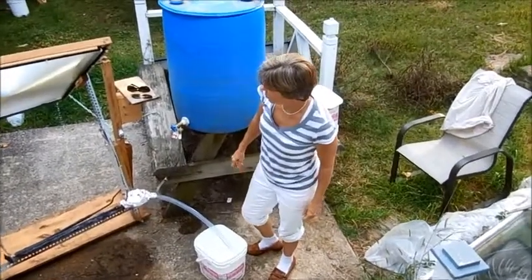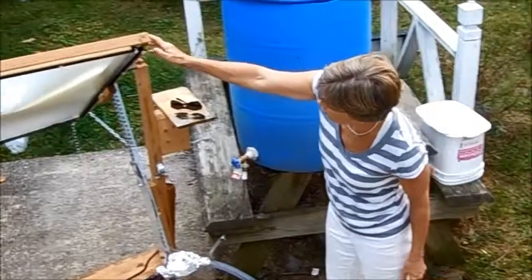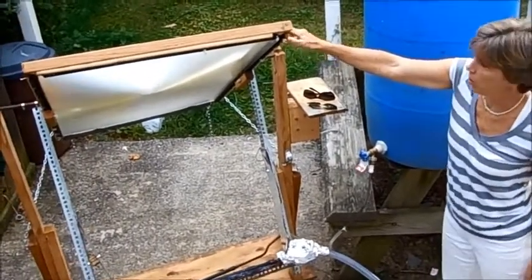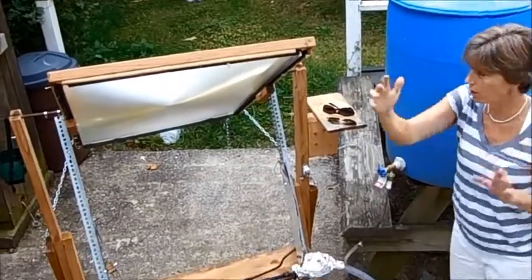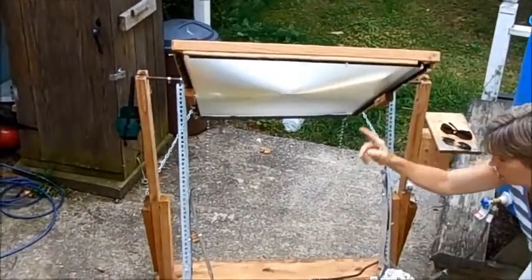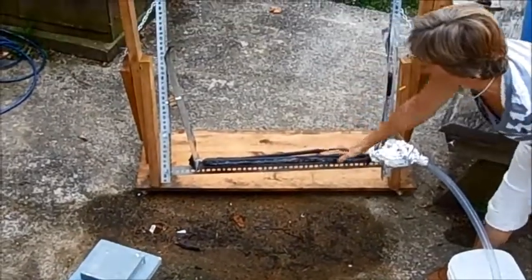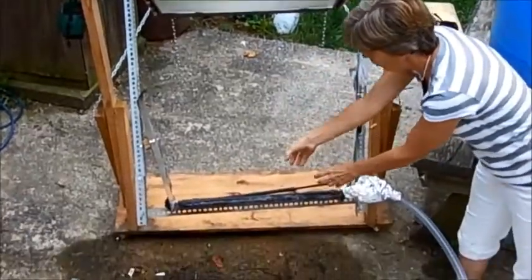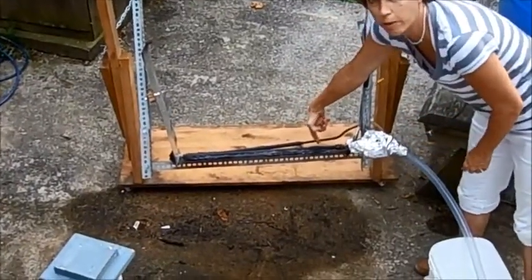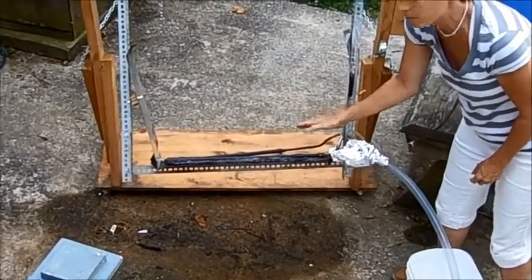There are just a few components to this system. This is the Fresnel lens — it's a 62-inch lens. It takes collimated light coming from the sun, which arrives straight, and focuses it to a point. The focal spot of this lens is located about here, behind this black coil. The black coil will intercept the incoming radiation and put it in a spot that's about 3 inches by 4 inches. The spot is not at the focus — it's inside of that — so the temperatures aren't excessive.